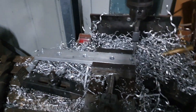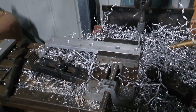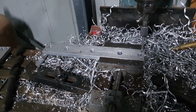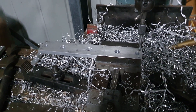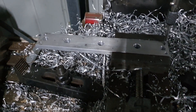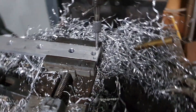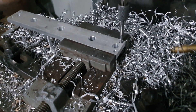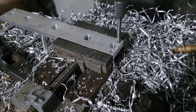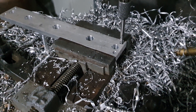Hello everybody. Just a little bit of work on these bus bars for my lithium titanate battery. That's a bit of 40mm wide by 10mm thick aluminium strip. The three centre holes are 12.5mm, each end has got a 10.5mm hole, and I'm just about to tap a 6mm hole in all four corners, just for adding wires and stuff like that for BMS and monitoring.